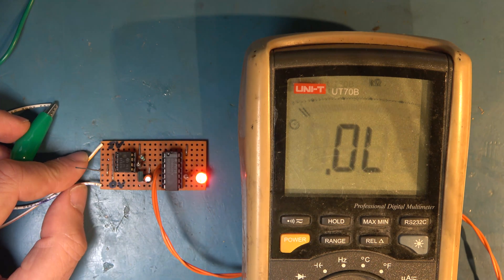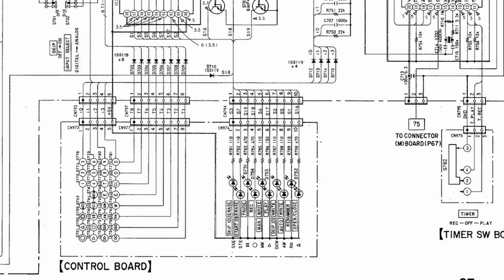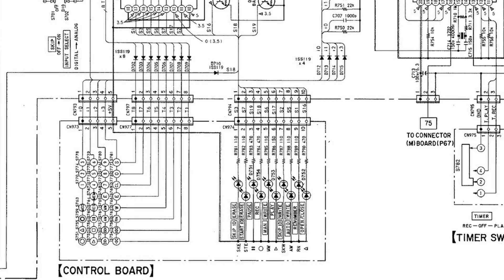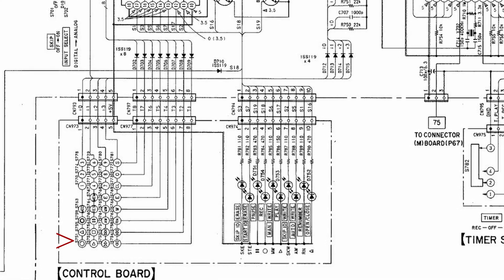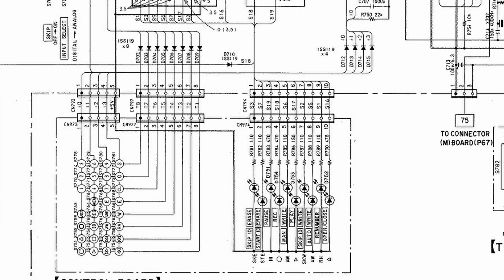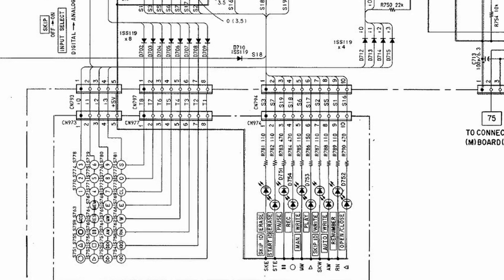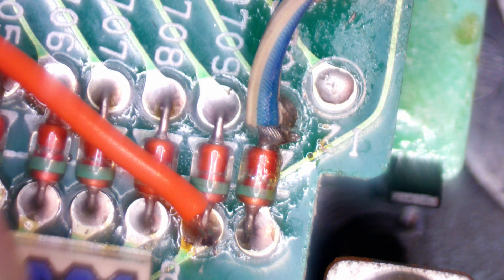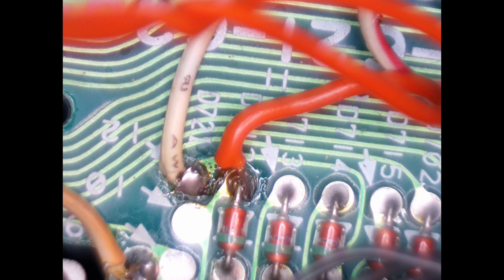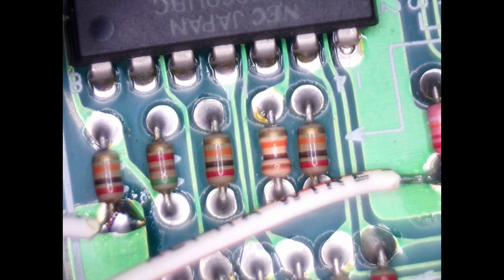So I need to integrate that into the DAT machine, either with a switch or using one of the switches already on the machine. Looking at the schematic for the 2500A — the DAT recorder part — we need to contact together the record button point, which is available on connectors. But it's going to be slightly easier to make contact on the diodes which drive the matrix on the PCB rather than interfere with those fragile cables. I also picked up five volts from a nearby IC.